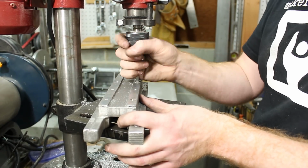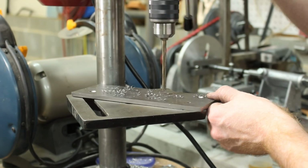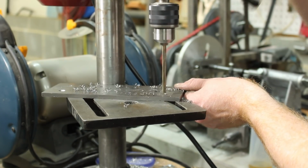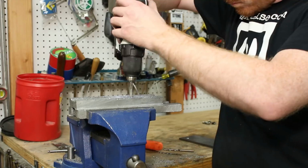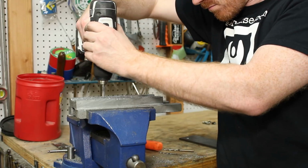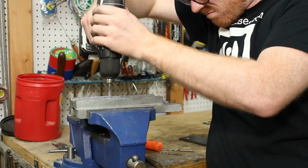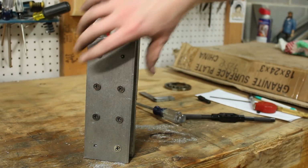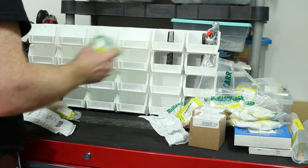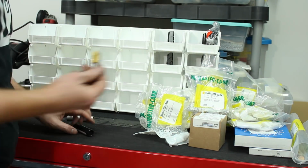After those holes are drilled, I start the taps in the casting. Then I enlarge the holes in the ways with a 6mm bit. And then I went ahead and finished tapping the hole, this time using the tap in my handheld drill. That made that a lot quicker. I used the fasteners that I got out of the oil pump, at least temporarily until I got all my parts in, including my 90-degree countersink.